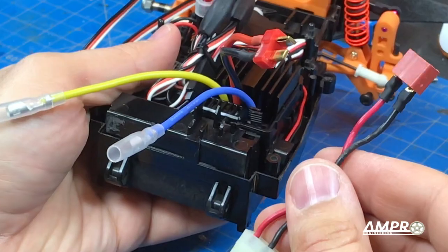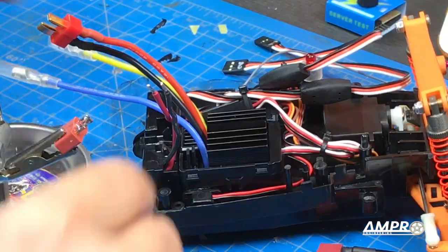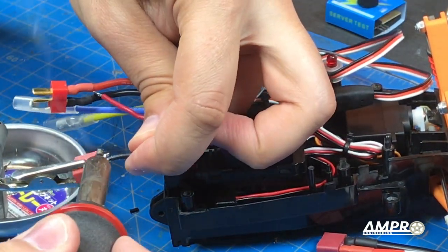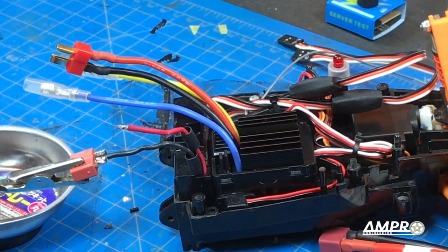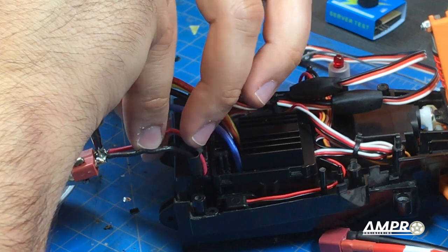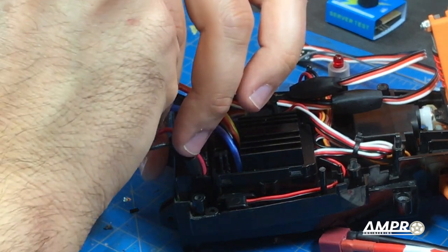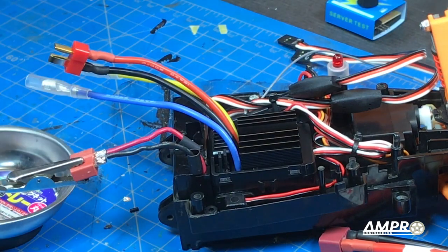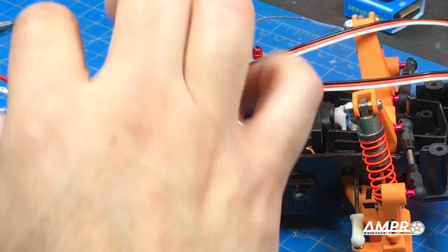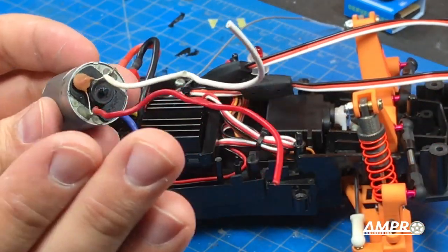Here is our adapter — I just realized the wires have to go through that hole. We shall attempt this a second time. In order to get this actually wired up, I have to send the wires through the hole where they were originally. I had to push the wires through the hole in the chassis. Now you might be wondering: did they do this to every single one of these cars when originally made? The answer is no — what happened was the Molex connector had the little terminals already crimped, and they just pushed the terminals through one by one, then slipped them into the plastic enclosure. Now I know we have to wire the motor up, and my plan is to route the motor wires into the electronics bay, but I'm almost positive the motor wires have to go through something, so I'm going to let this be for the time being.